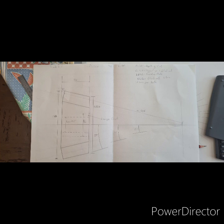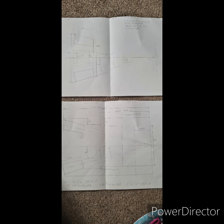So as you can see here, I've decided to follow Ivan Law's book on cutting gears. He says about using parallel depth gears, which I've done, and I've laid them out as per his instructions in his book. You can see that they're 6 diametral pitch. Depth of cut's going to be 0.36. I'm not sure my little Warco will handle that, but we'll see. As you can see from the pictures, I've already worked out the amount of offset and the amount of rotation for the second cut, which you'll be able to see in future pictures.